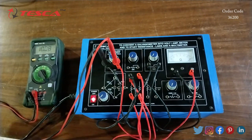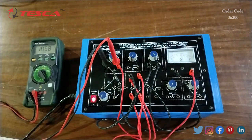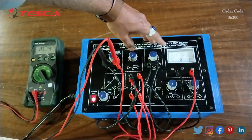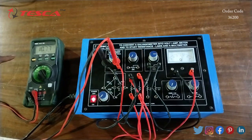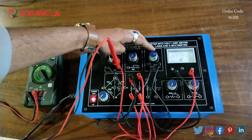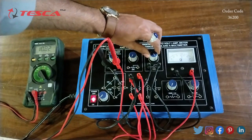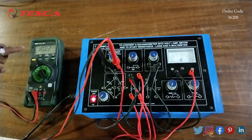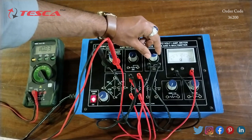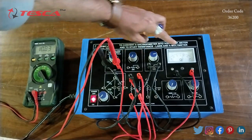On the multimeter you can see that we have given 10 volt DC supply. Now we will rotate the 100k ohm pot to the fully clockwise direction and take the readings. When we rotate it in the anti-clockwise direction we can see changes on the galvanometer — the voltage increases as we rotate clockwise and decreases as we rotate anti-clockwise, meaning the resistance is decreasing. At fully clockwise, maximum resistance of 100k ohm is present and the voltage reads 10.82 volts. As we reduce resistance by rotating anti-clockwise, the voltage also reduces, and we can observe the corresponding changes in the galvanometer.